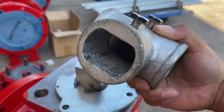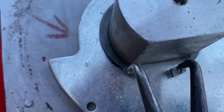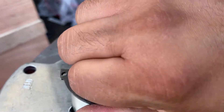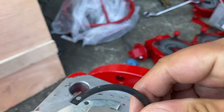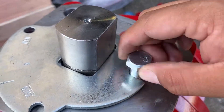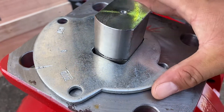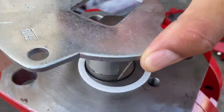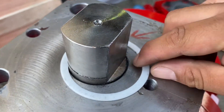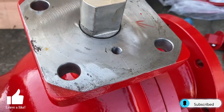This is the t-bar here, and this is your stem. We're going to remove the lock ring here which holds down your stop plate. This is your lock ring here. Here's your stop pin or bolt. Now this is your actual stop plate which we will pull off. And here at the bottom you have the thrust washer. So now everything is removed.